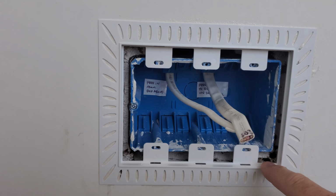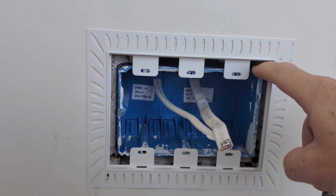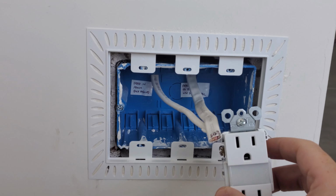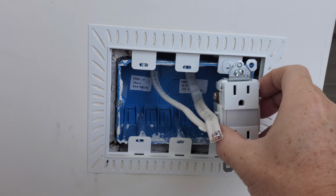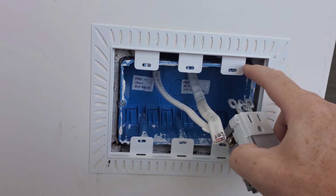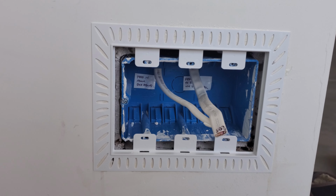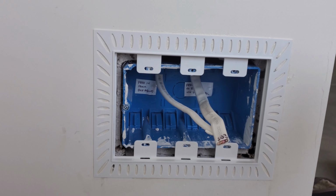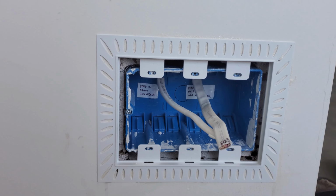But the cool thing, so when you cut the drywall and you install this and glue it in, it gives you a chance to make it level and square without being dependent on the box for that. The downside is that typically the depth of your outlet, these metal plates will catch the edge of the drywall, and that will help normalize the depth. So the downside of these is that doesn't happen, right? By the time you get this in here, that extra 1/2 inch you cut means this metal plate will kind of land up here somewhere. So on the flip side of the coin is that you have to do something to make sure you have a chance to adjust the depth. But at least this ring, after it's glued in, it's actually pretty strong. It sticks on there pretty well. And so that kind of helps level it out.